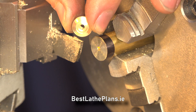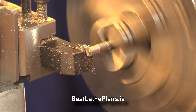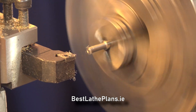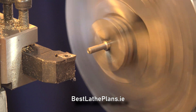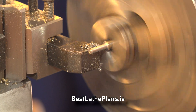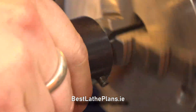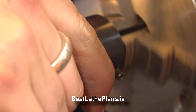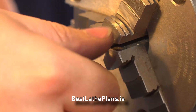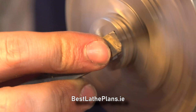I did realise later that it's better to make the piston to fit the cylinder, however I've done it the wrong way around this time. So, completely ignoring that previous point, I mounted some 3/16ths mild steel bar in the chuck — that's 4.76mm in real units — and turned the threaded part down to the correct dimensions. This was then threaded using the correct die to match what had been threaded into the hat. I gave the threads a quick clean with the brush and then tested the two parts fit together correctly. I then used the opportunity to give the hat a bit of a polish just to make that finish a little bit nicer.